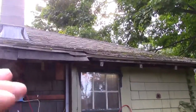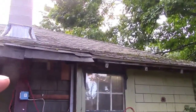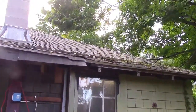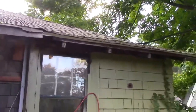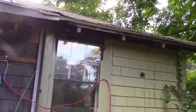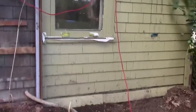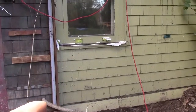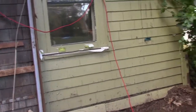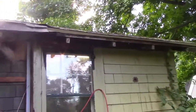So I got to cut into the roof because of the angle. If I follow the angle that's there, which I was hoping I would be able to, by the time I got out to 12 feet, I'd be bumping my head. And that's if I had the floor on the ground. Now, as you can see, I'm going to be off the ground, probably 18 inches or so. So I got to get ready and put some sonotubes in and dig some holes.